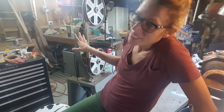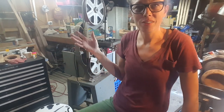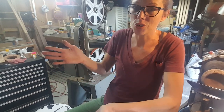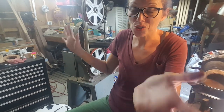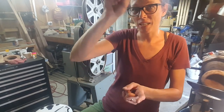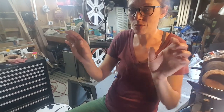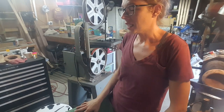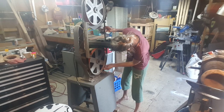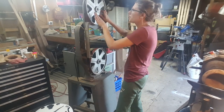Probably now would have been a good time to re-watch it right before I started this. But if it's your first bandsaw experience, that's a really good video to brush up on. I'm just showing you what I'm doing and it may be wrong, so you can laugh at me. First of all, make sure the teeth of your blade are going down, because I made that mistake one time — got everything all put together and then the blade ends up flipped. Live and learn. Also make sure it's unplugged — you don't want any accidents.